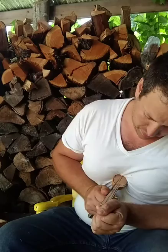This area right here back in the neck is where most people say that they over carve a spoon. One of the most useful things you can do right now, at this early stage of carving, is to just not try and get it perfect. You can see it's all ragged and rough and it really doesn't matter — what's more important is that I don't over carve it.